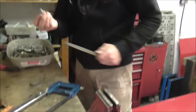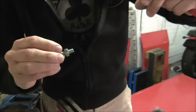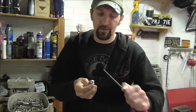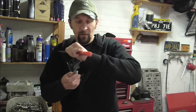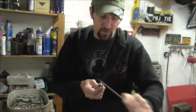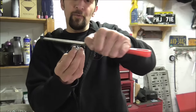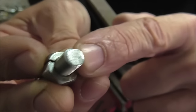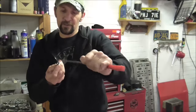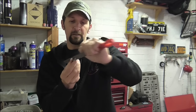Take it out and take a file. On the end there, the saw going through has made a bit of a mess of that end thread, and if you tried to screw a nut on that — or worse, screw it into an aluminium engine casing — that would cause damage. So take a file and go backwards with the file. Yes, filing backwards can damage a file, but they are cheap as chips and it gives you a good job. Just gently stroke backwards at 45 degrees to the thread. You've made a nice cut — it's a nice, smooth, clean cut — and you're just taking the burr off and rolling it inwards, away from where it needs to be.